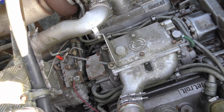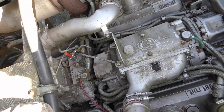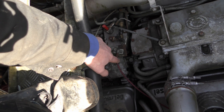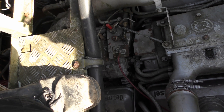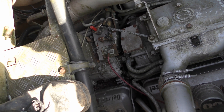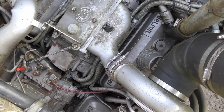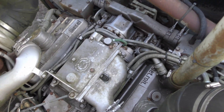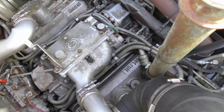This particular engine is a 12V92. The 12 is obviously 12 cylinders, V is V-formation, and as some people have rightly said it's actually made from two V6s bolted together. You can see this is a governor assembly with the throttle and the stop on it, and between the two superchargers there's a connection for the drive. So in theory I could split this engine into two V6s - the cylinder heads are separate, the blocks are two separate castings, and I believe it's actually got two separate cranks, one for each block. The 92 stands for 92 cubic inches per cylinder, which is what makes this an 18.1-litre. They're quite an interesting engine but I won't go too far into the details. Let's start taking some bits off.